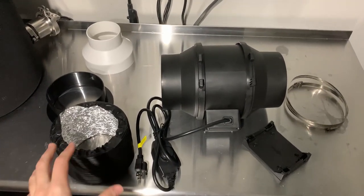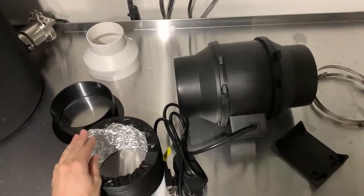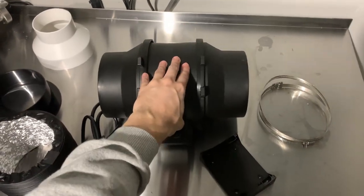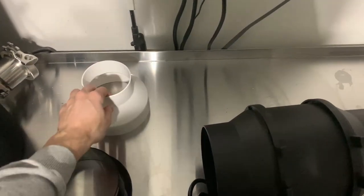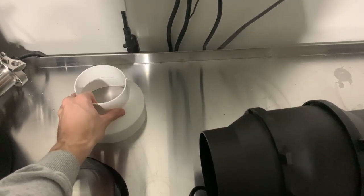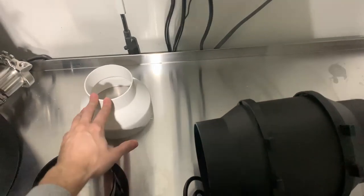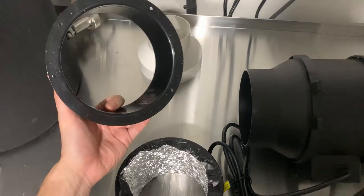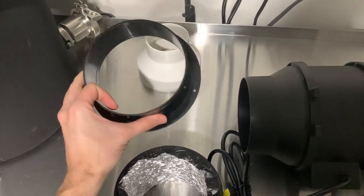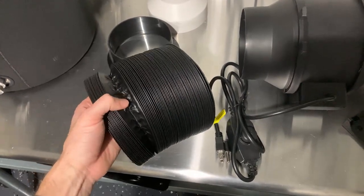As far as parts you'll need, I'll put some links down in the description — I bought everything off Amazon. You'll just need an inline fan and a reducer. In my situation I had a four inch HVAC setup and this is going to be a six inch setup, so I needed a reducer to run this to the outside vents. You're also going to need something to hook up the HVAC hose to the hood vent, and obviously some six inch HVAC tubing as well.